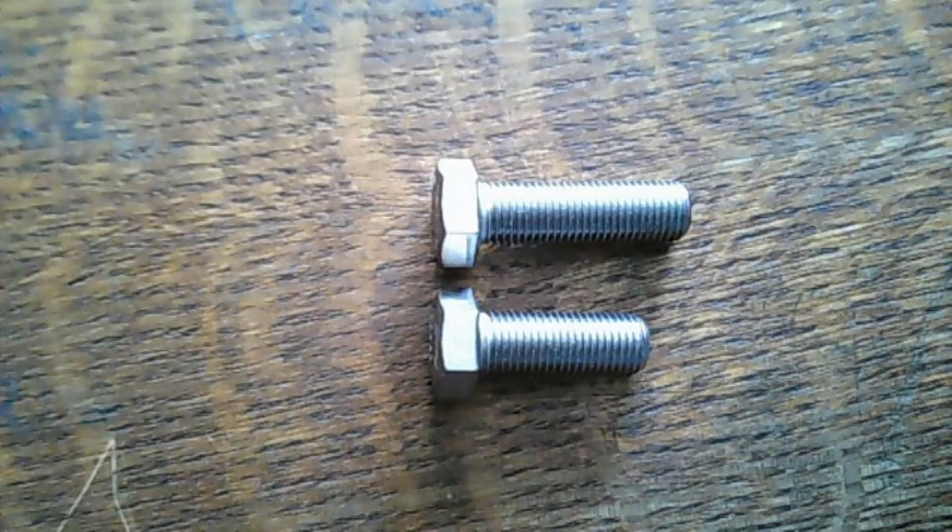Finally we have the bolts. I just went to my local hardware store and got stainless steel bolts. There are two kinds: one is one-and-an-eighth inch, and there's a longer one. You use the longer one for the connectors with the fiber washers in them because they take up a lot of real estate — they're fairly thick. That's basically all the components you need to build either a grounded element connector or a driven element connector, which we'll talk about next.